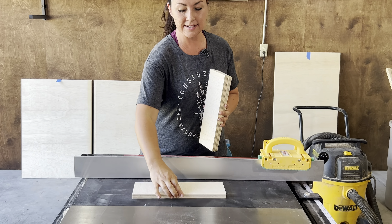With the fence set we bust out the old table saw sled and get the top strips cut to length. Our Harvey table saw allows us to slide the fence back so we don't run into any hairy kickback scenarios when making these cuts. Next we need to drill some pocket holes in the strips. In moving here we upgraded our pocket hole jig to the Kreg 720 and this thing is sweet.